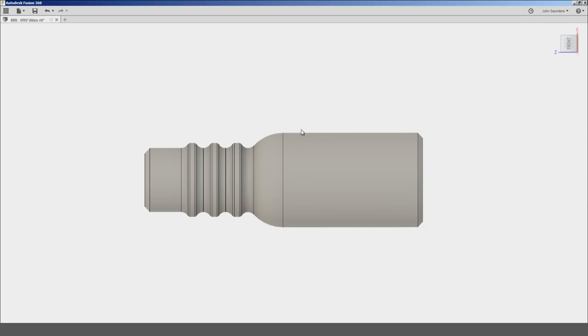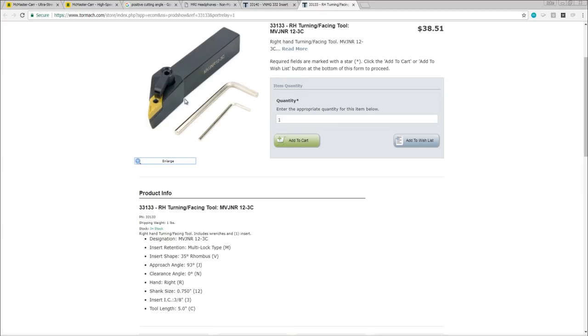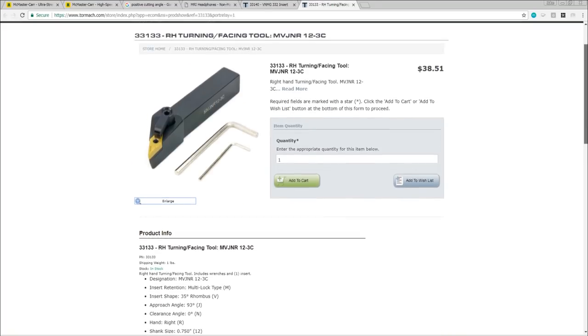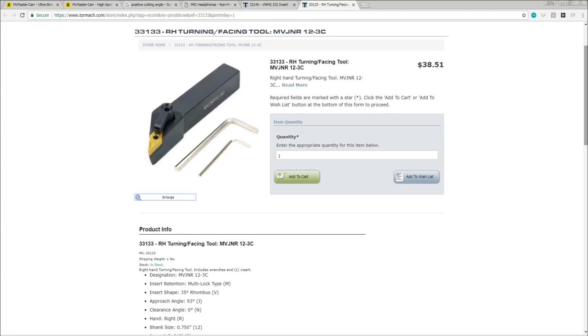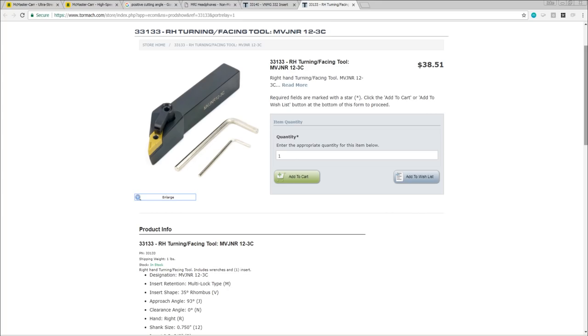The last way — and probably the best way to tackle this — is tooling. We're using an off-the-shelf VNMG insert. Most importantly, we can see it's a negative insert with a chip breaker, recommended for steel roughing. The holder also has a downward angle, so we've got a negative insert and a negative holder. One of the things I struggle with on lathes is there are so many options for tooling, recipes, and inserts — card here to the video we did with Paul Diebold evaluating different styles of inserts and how much they change with horsepower and cutting style.